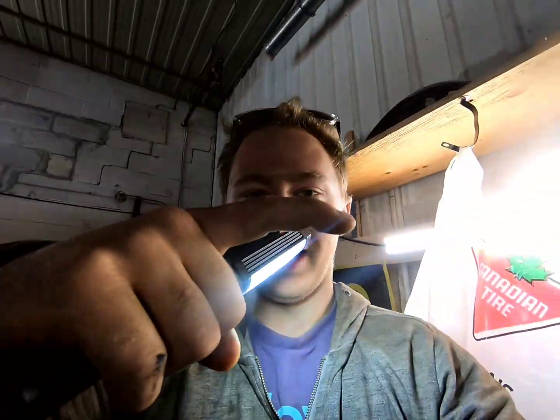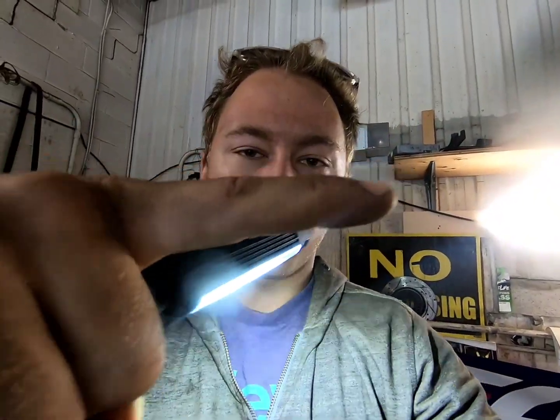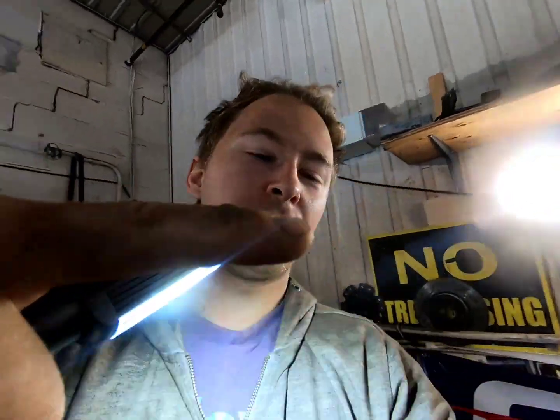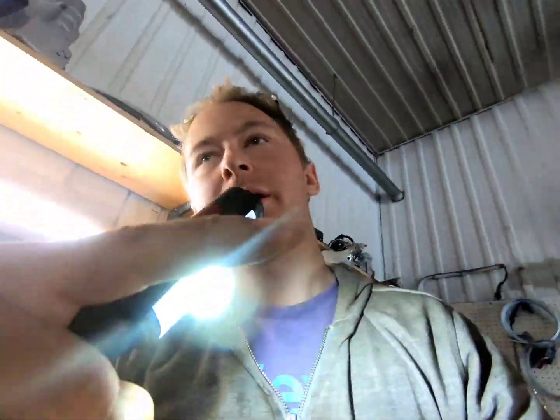If the bar is slightly bent up or down, it has to make up the slack before it'll actually give the force to the rear. So the straighter the better. So obviously that's what I'm gonna be aiming for. So I gotta take some paint off, grind it and all that, and then throw some beads on.